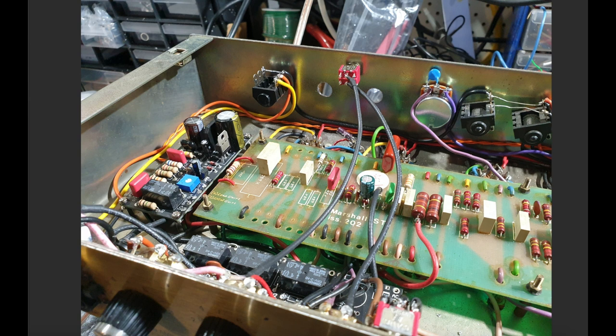This is the 0.68 microfarad bypass cap for the second gain stage. So remember, there's that funny old switch on the rear of the chassis. Those two red wires there make their way back up onto the board over here. What I'm doing here is using that switch to switch this bypass cap in and out of this cathode here. So that's our little structure switch. This red wire here, I need to show you this while we're here. This is tapping off the preamp node.